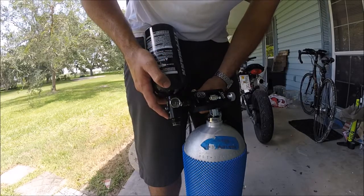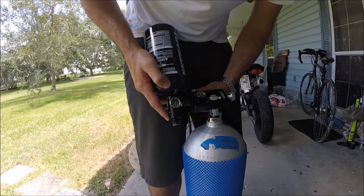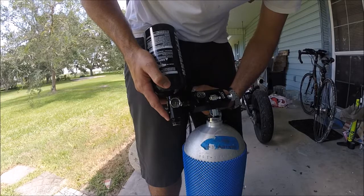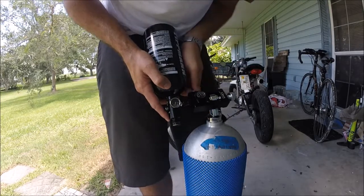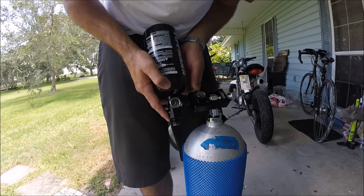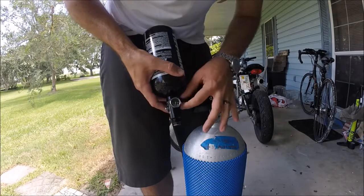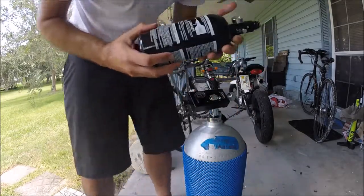You could probably go more — up to 3,200. Oh, look at it going down a little. Put a little more in it. Cut it off there. Now to get it off, you loosen up your vent, tighten that handle, loosen up your vent, bleed the pressure. Then you can take your tank off of the fill station.